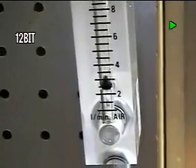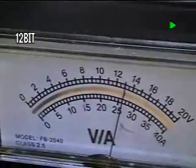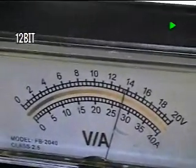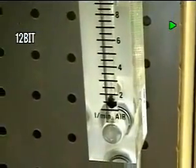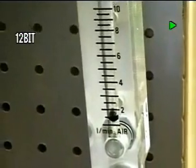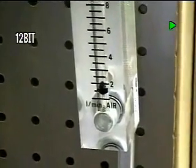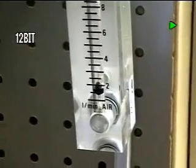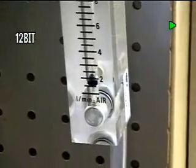Let's do 13 volts and see how it reacts — we'll be up in the 28 amp range. At 27–28 amps: nothing. Too much current — nothing. All we're doing is conducting electricity through the electrolyte and not producing any gas. There is too much power to the electrolyte. So there is a point with HHO where if you put too much juice to it, it'll just cancel itself out.